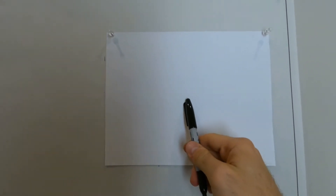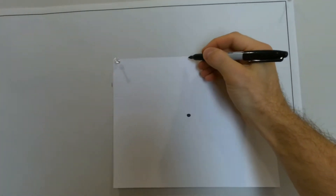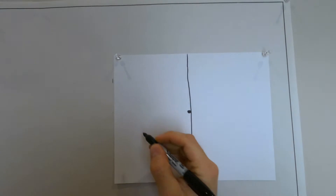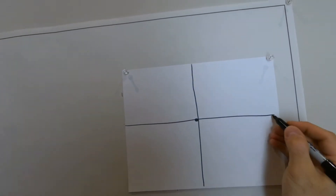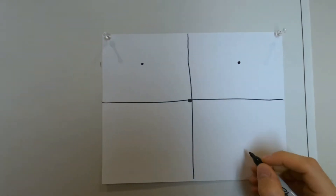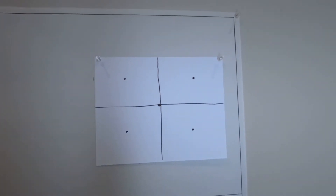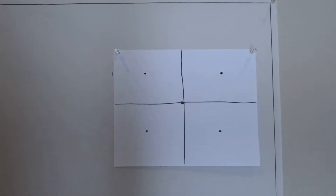This is a little bit of a trade secret as a licensed electrician that I use all the time. So let's say this is a room and if you did one light fixture, just one, it would make sense to put it in the middle to get the best light distribution. What if you did four light fixtures? Well, the way I do it is divide the room into four equal sections and put a light fixture in the middle of each of those sections. Don't you think that this is probably the best way to do the lighting layout for best light distribution? I think so. So stay tuned and I'll explain.